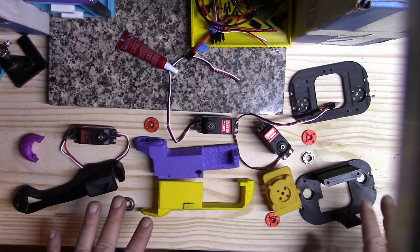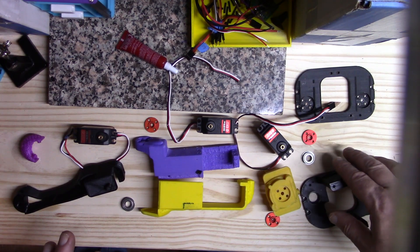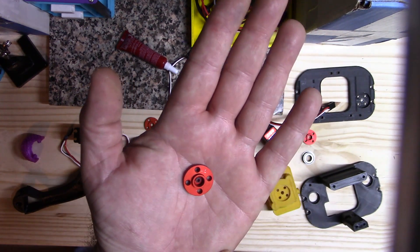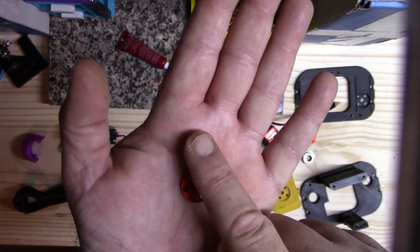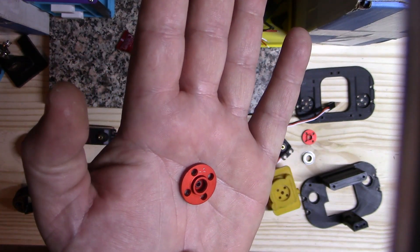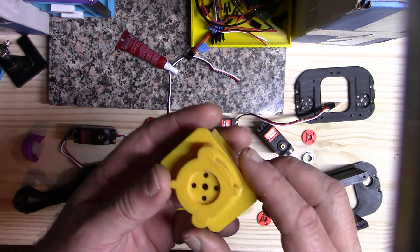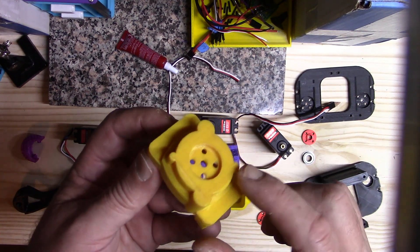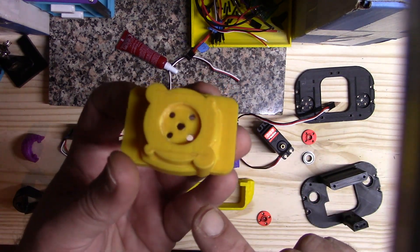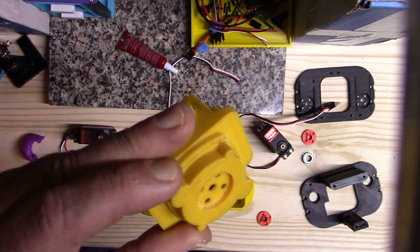So really quick — this is what it entails. You have your two shoulder pieces, be it front or back, and there is a difference so keep them paired. Then you'll have three servo horns. I redid these parts to use aluminum servo horns instead of the plastic ones, which wouldn't be the best idea. That's why this piece is a funky shape — it was originally made for the cross-bar plastic servo horn, but I just plunged in the aluminum servo horn space.